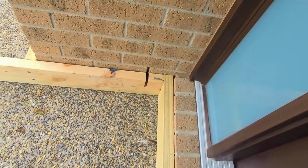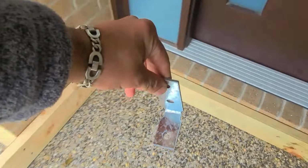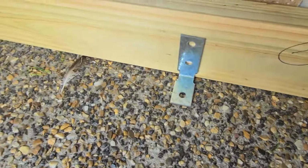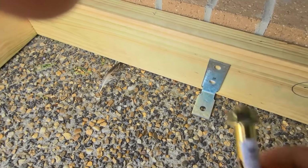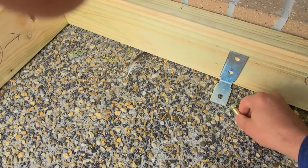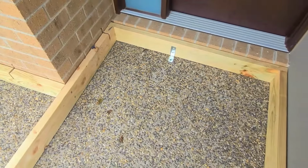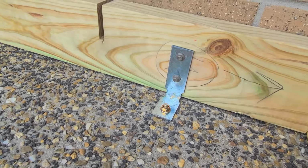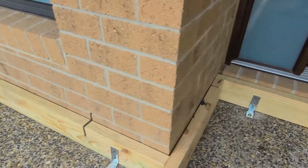so it's still compliant. So today I'm going to drill like this. I'm going to use these brackets to hold this and use this DynaBolt. It needs 10 millimeter drill. So after that the frame will be locked. So let's see how it goes. This is how I install the bracket and anchor, and here it is.